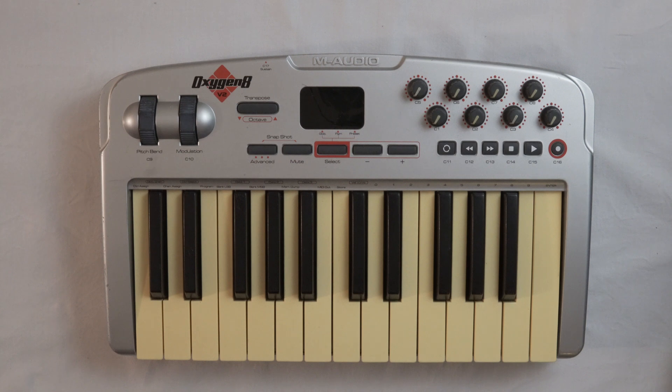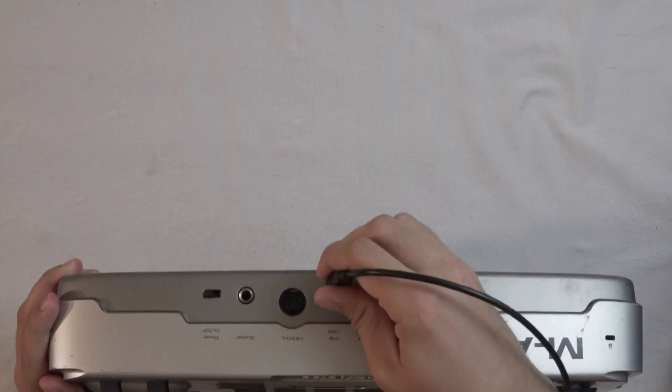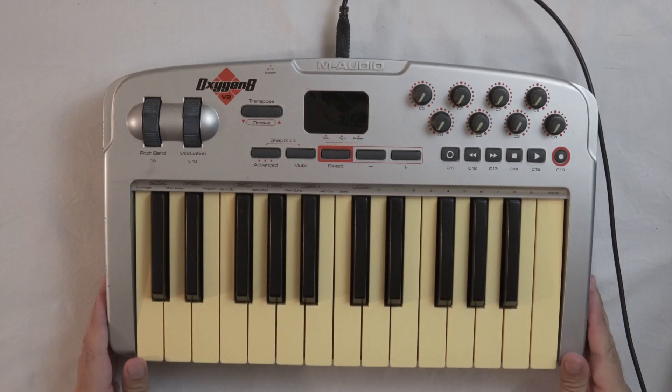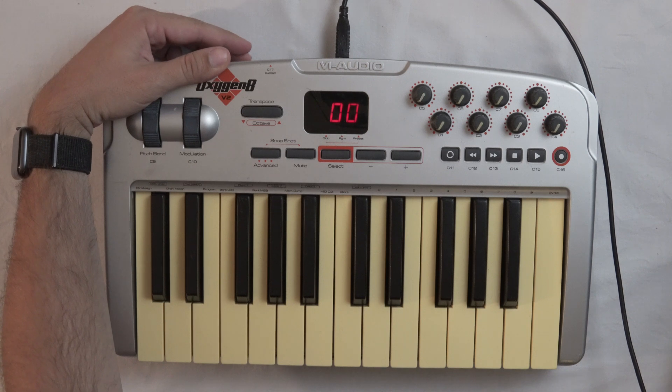Now all that's done and I'm ready for the final test. I tested it off camera, so I would suggest before you reassemble everything and put all the screws back in, just connect the ribbon cables and then plug it in and see if the board turns on. Then once you've done that, it's just the reverse assembly process — screw the PCB back in, flip the board over, and put all those other screws back in. And now here's the moment of truth. Turn it on. And it works.